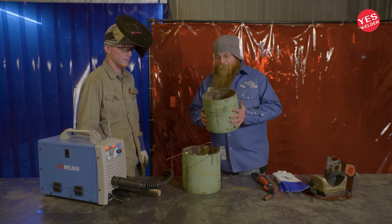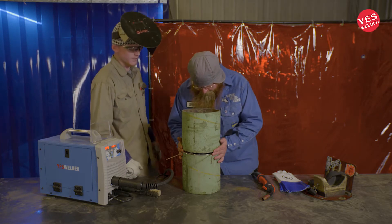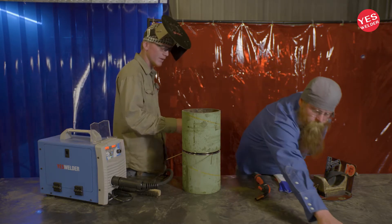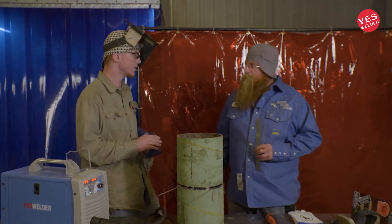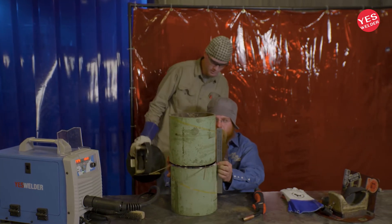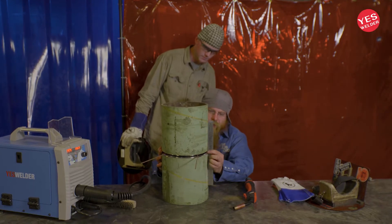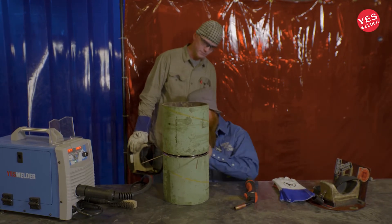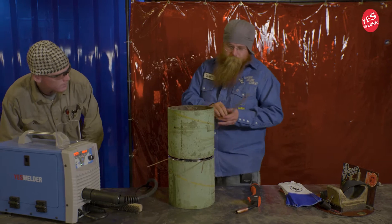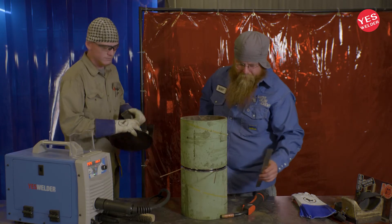Now we're going to get our fit-up. Set that right here. Get our high-low — you know what high-low is, right? What is that, Colton? It's your difference in pipes... Yeah. So if you have a bad fit-up, you can have high on this side, low on that side. It's pretty self-explanatory. So your high-low here — you can always check with a ruler. If this has got high-low in it, you're not going to fit up perfect. You can use a tape, a wedge, anything. Try to get that high-low set just right all the way around. Sometimes on the bigger diameters you got to adjust a little bit.